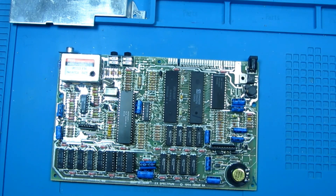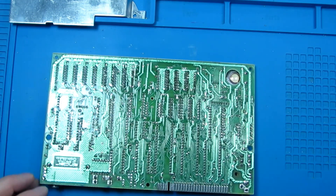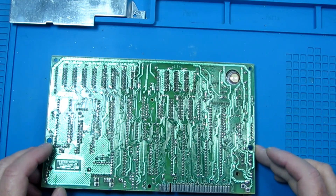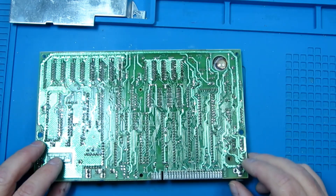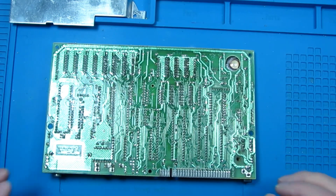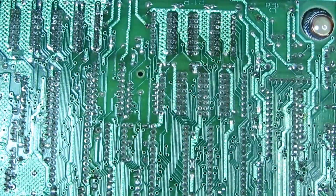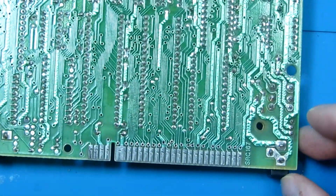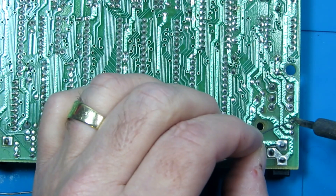So that's the part we'll be taking out. Turn on the desolder on the station. I think first I'll add a wee bit of solder. I'm just going to zoom in a little — hopefully we'll be able to see it a bit better. While that's getting up to temp, I'll add some fresh solder here.